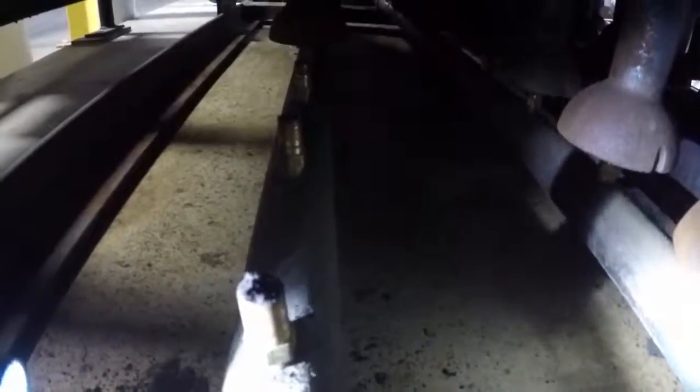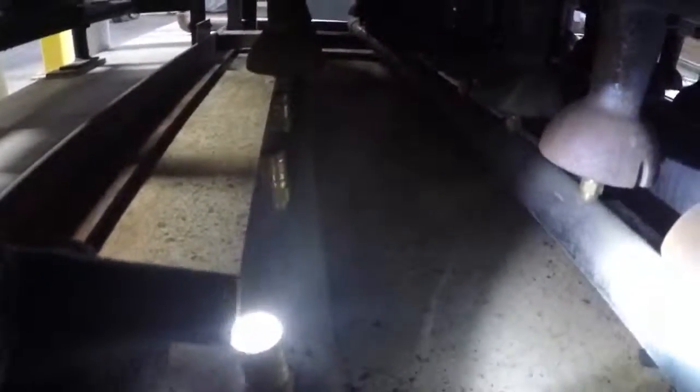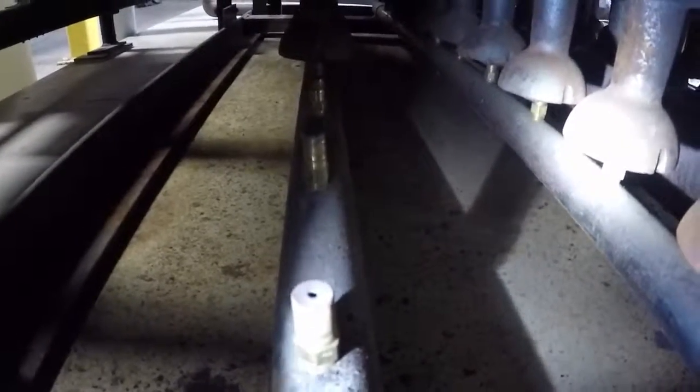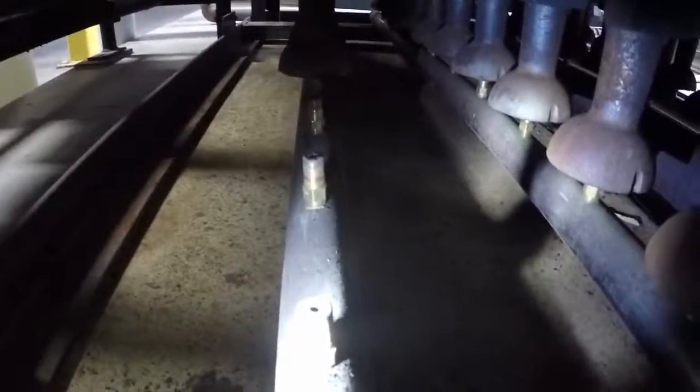Never — never take a drill bit to those orifices and drill them out in order to clean them or change something about your orifice. See, I just knocked them right off — they are all good. We will clean them up a little better than that, but if you clean it with a drill bit you will change your orifice size and all of your burning parameters, so don't do it. Somebody will have to come in and redo all the adjustments, and it probably won't be you.